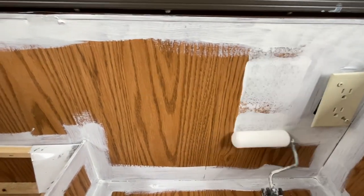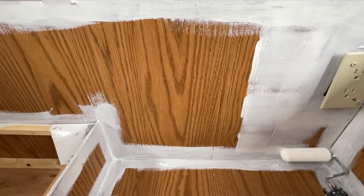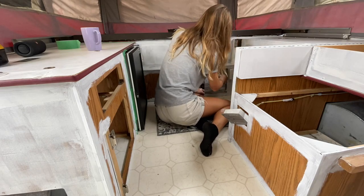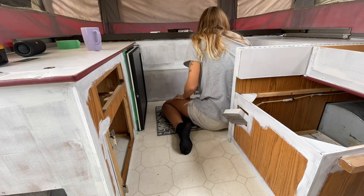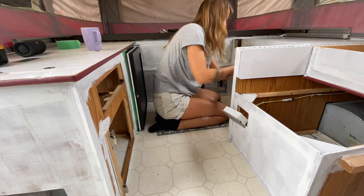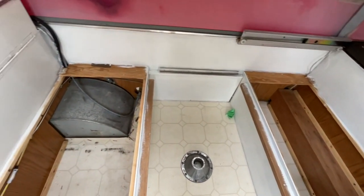After I did the doors I did all the trim on the inside, then rolled the middle. You definitely need two coats of Kilz. It was super fun to cover up that wood. I noticed my floor is white but with the white primer it actually looks a little bit yellow, so for my color choice I ended up going a little bit darker — because if I went with white like the primer, the floor is just going to look yellow.